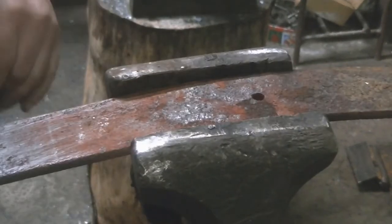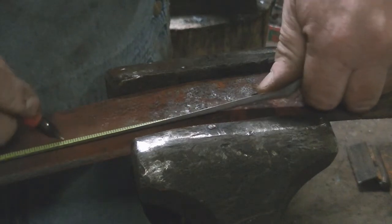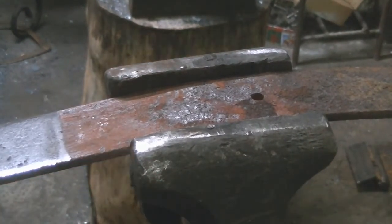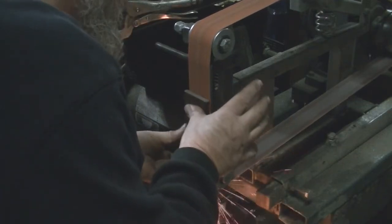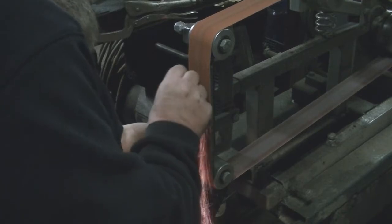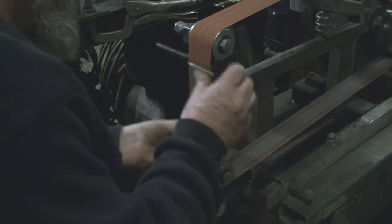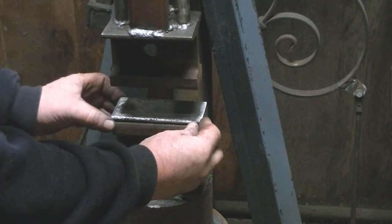After brushing and heating it, you have to remark it — you can kind of see our line there, but we mark it at five inches. We're going to take the big grinder to it and get as much of that rust off as we can, down to some clean steel. This thing is going to take some abuse, so I wanted a good strong piece of steel, and I figured this old spring steel is probably it. Over to the sander to sand it down and round the corners up, to keep sharp edges off the corners of the hammer so it doesn't leave square edge marks on things. Nice shiny face and it matches the anvil.